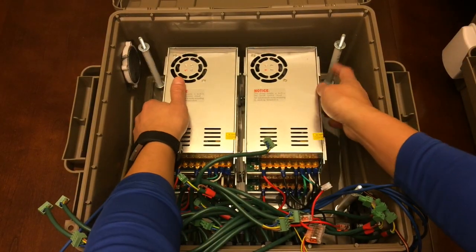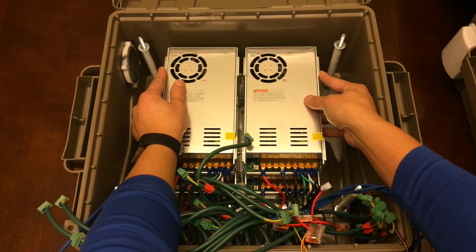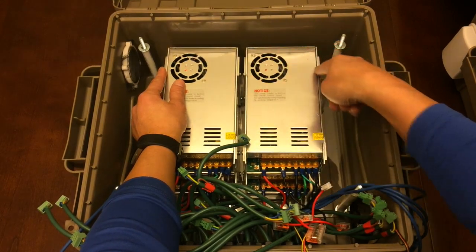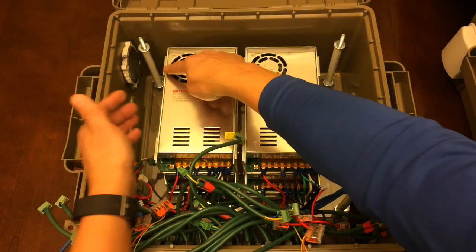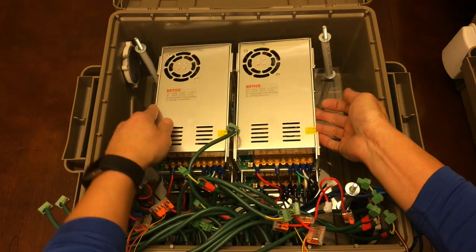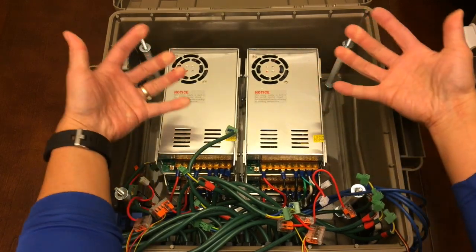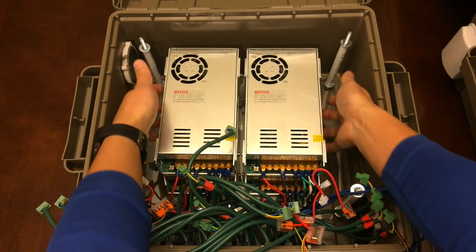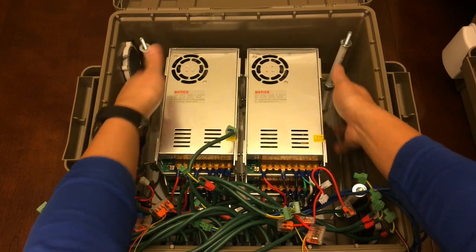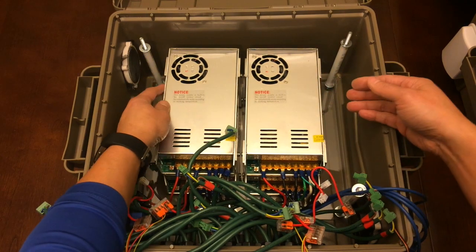The aluminum pieces here on the side are 1.5 inches. There's a 48-inch stock piece I got, and I cut it into even lengths, so it goes 1, 2, 3, 4, 5, 6, 7, 8. The nice thing there is once you have them, you just drill a few holes in the side. You kind of align them up. And then on the bottom plate, there's screws that you just line them up, drill some holes, and then mount them. All of these power supply mounts are using the M4 screws.